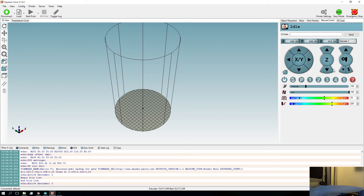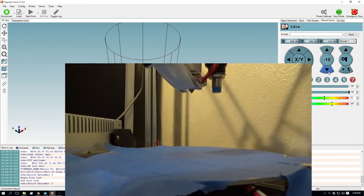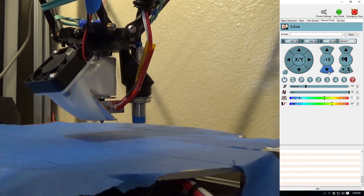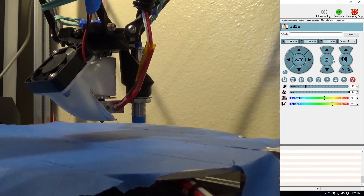Without stopping the motors, go over here to the Z controller and lower the Z. You're gonna want to basically just keep clicking it all the way down. Don't do it too fast because it can start to skip commands that you give it and then it's gonna throw things off. So just head on down. Once you get pretty close to the bed, you're gonna want to start using the negative one movement and not the negative ten. Get it pretty close, and then what you need is a regular piece of printer paper.